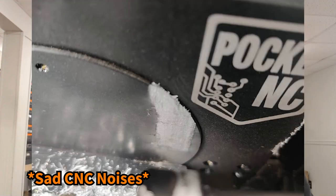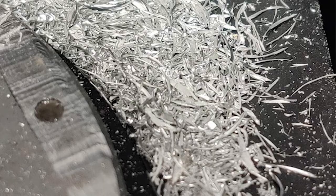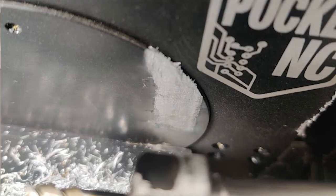Well, it should have been easy enough, but it wasn't. It did not go particularly well — I crashed my machine. This was the original vice I tried making the first time; unfortunately it is now scrap. At some point as it was running, there was a big buildup of chips on the table, and when it went to move its rotary axis, some of the chips fell into the gap on the B-table, jamming it up and preventing it from turning. So the tombstone ended up at an angle. The machine didn't know it was off-angle, so it was trying to machine in the wrong place. Eventually it lost steps and crashed against the edge of the machine itself — pretty heavy aesthetic damage, though thankfully no permanent damage to the kinematics.